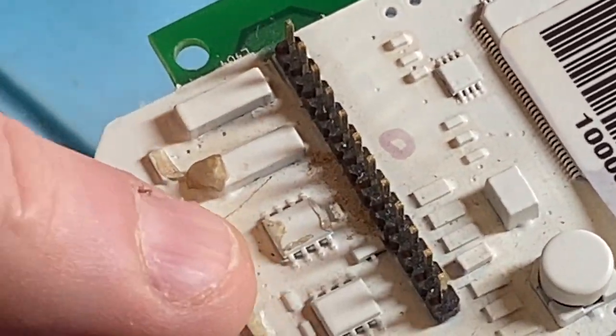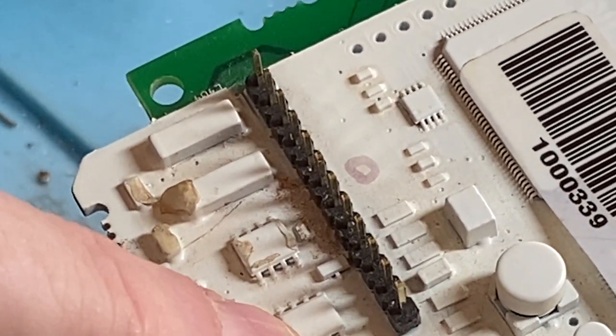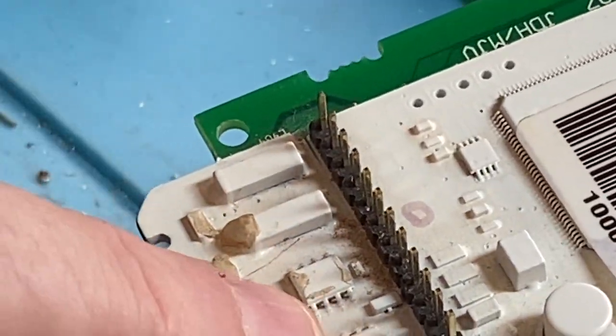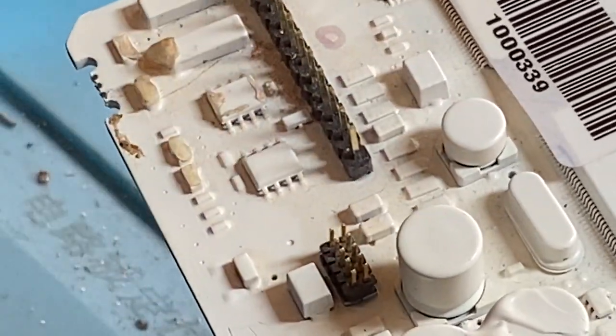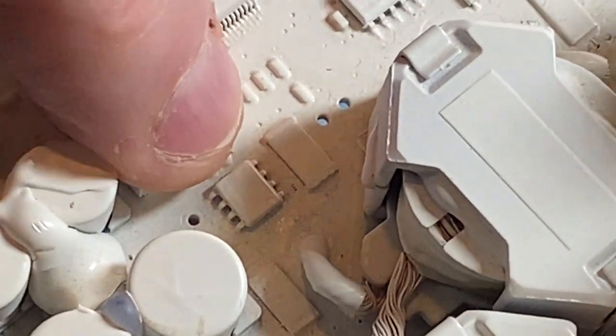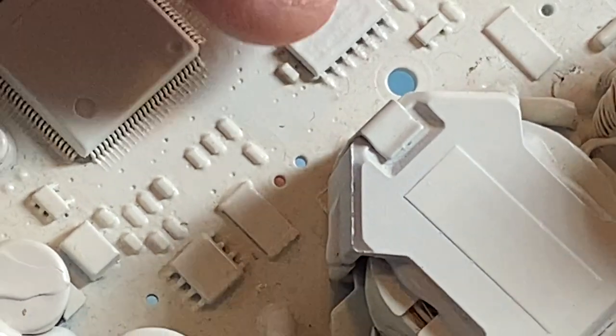This is the power supply here. There's just two FETs. I think they're in series. If something goes wrong here, you're not getting any gate voltage, so you're not going to get turned on. We're not going to have smoke, hopefully. That's another MOSFET, a P-channel that drives your switching transformer. And your comparators are here.